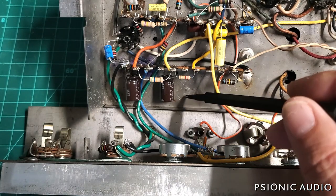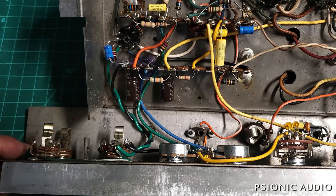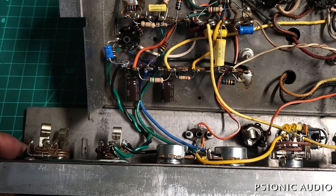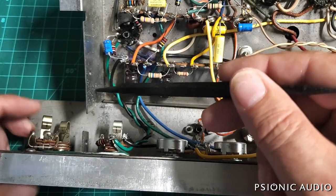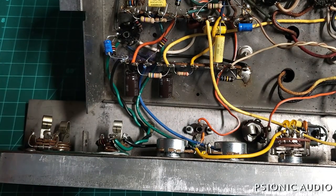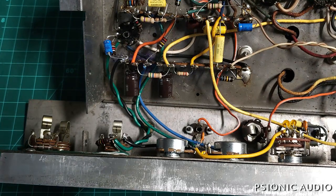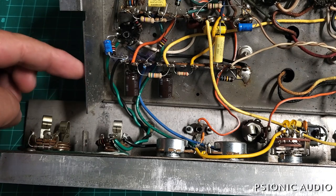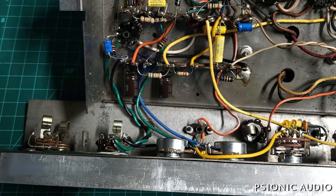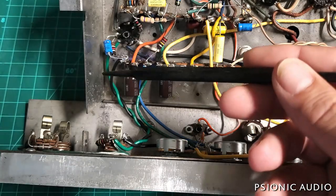This chassis is in two parts. You have this shell, which has the bulk of the circuit in it, and then you have this front panel, which has all the jacks and pots. When they all go together, there's a little metal tab here which lines up with the metal here, and you put screws on either side and it holds this to this. So if it had no wire from the jacks to the ground here, you would not have a ground loop, but you'd be relying on relatively poor metal-to-metal contact that's just mechanically holding it together. That would not be a very reliable ground — if that screw came loose as the amp vibrates, you'd lose ground.